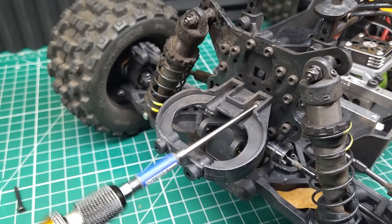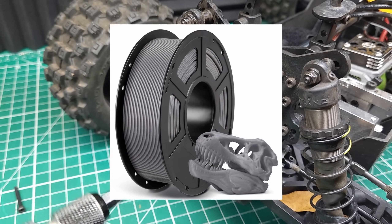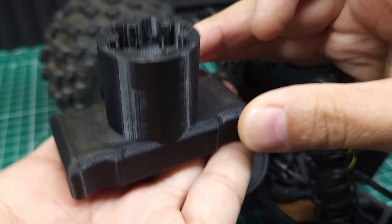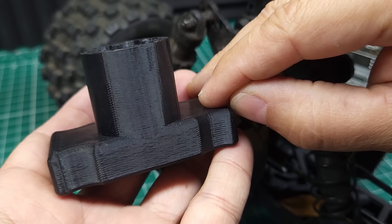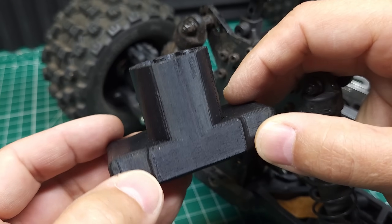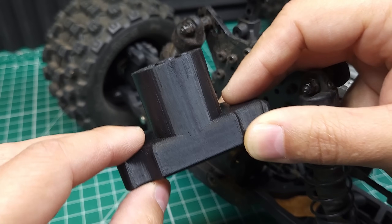The type of 3D printing we're going to be using today is called fused deposition modeling, or FDM. That's just a fancy word for using filament that gets squirted out of a nozzle in a very specific and precise pattern to create a 3D printed part. If you look carefully, you can see layer lines. Those layers are also the weak point — wherever they connect, that creates an area that isn't as strong as the parent material, which is why FDM 3D prints almost never are as strong as their injection molded or laser cut counterparts.